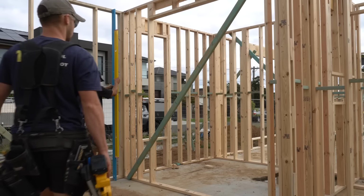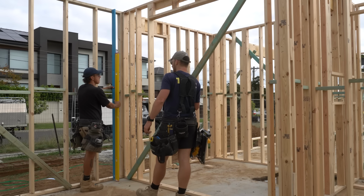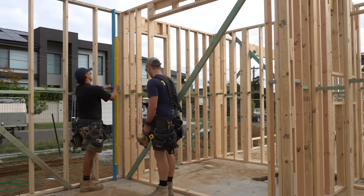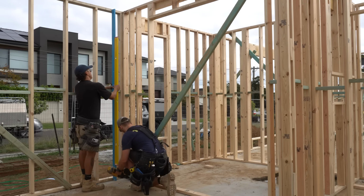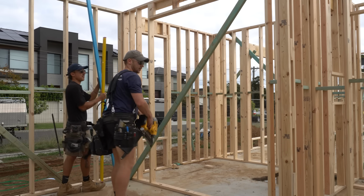Yeah, what we'll do is we'll shoot these off. I'll do 1 nail and then we'll run a string line because that's a long wall. So we'll just get them roughly plumbed. I'll do 1 nail and then we'll double check it with the string. Hit it to you. To me? Yeah, you can probably come like 3. Yeah, shoot that. Yeah. Sweet. We'll just leave that for now.